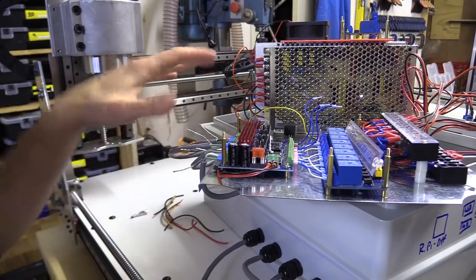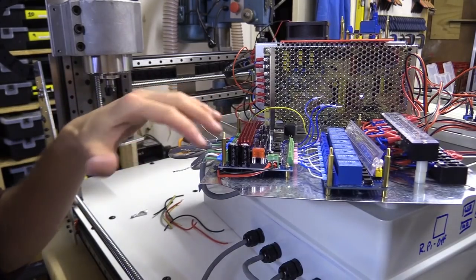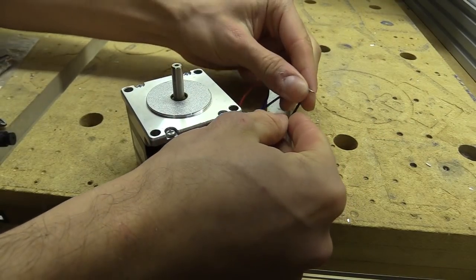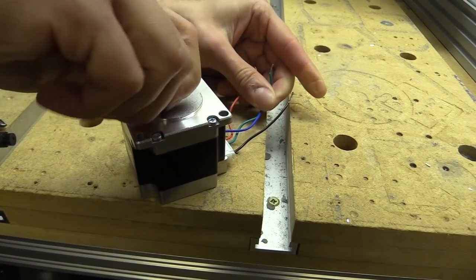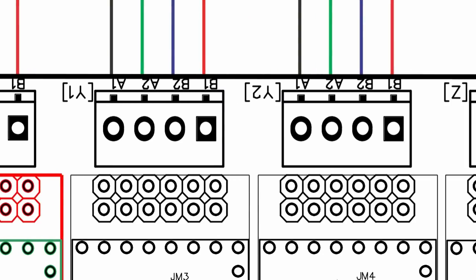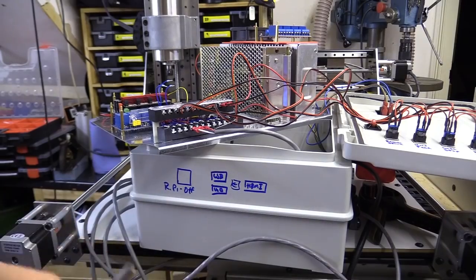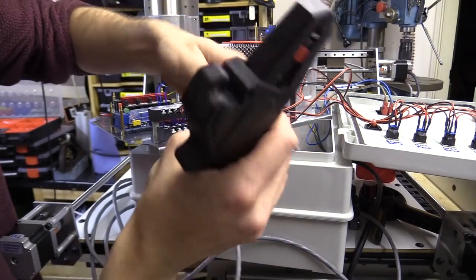I'm jumping ahead now wiring the cables through the glands. My stepper motors have four wires so they are bipolar with two motor windings. To wire up your steppers you need to identify the pair of wires for each winding — I did this by simply holding two exposed wire ends together while trying to turn the motor shaft; if it resists movement you've identified a pair. I wired one pair to A1 and A2 and the other to B1 and B2 on the control board. My Y axis uses two stepper motors so I need to make sure those are wired identically, and when I first turn the machine on I'll jog a few millimetres to confirm the axes are moving in the right direction. If not, I'll swap one pair of wires around in the terminal.